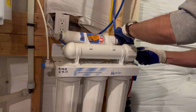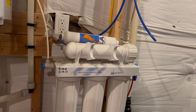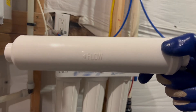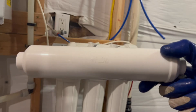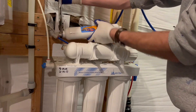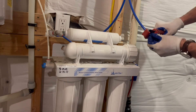This particular unit has a five-stage filtration process: the three pre-filters — which you want to do more often — then through the membrane, and then into the carbon filter. This one just threads on, and it does have to go in a certain direction of flow, so I want to make sure to put that in properly. These are just plastic threaded fittings — on plastic they seal up pretty good. You could put some Teflon tape on them, but this is usually good enough.